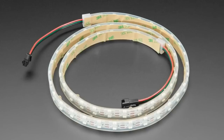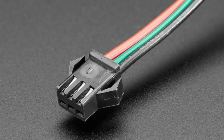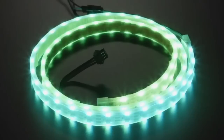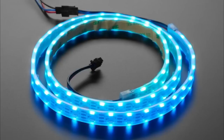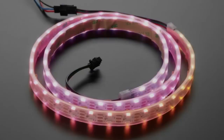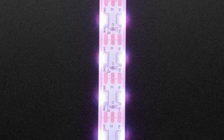It's a little confusing because technically it's 120 LEDs per meter, but you're probably like, the density is 60 LEDs per meter. That's because there's two LEDs on each side, right? So it's not as dense, but there's more LEDs. The LEDs are side angle and they go both edges out. So if you're looking straight down, you can kind of see light, but it's coming from the side.